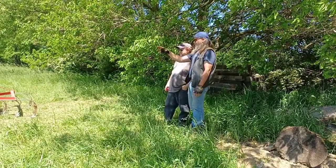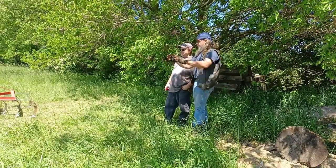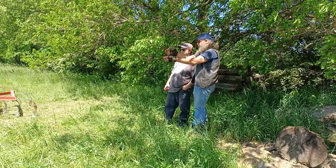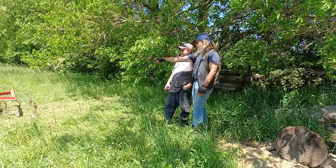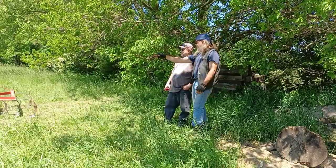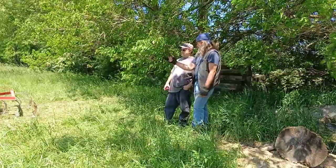Okay. Two big things. I run it in a split, so the edge of the last row, the center of the tractor, is going right over. And a lot of that, these outside tines won't go as deep as the inside tines unless those inside tines are really buried. It's in four-wheel drive, take off in low. Go at kind of a crawl speed.